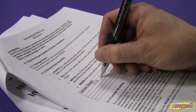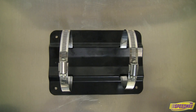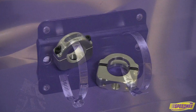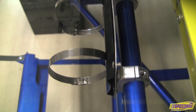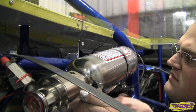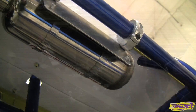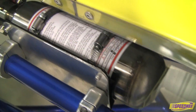The cylinder mount bracket can be mounted two ways: flat against the reinforced metal surface using the 3/16 holes provided and four bolts, or by utilizing an all-in-one accessory clamp to mount the bottle bracket to a roll bar. Test fit the cylinder onto the bracket to check the orientation of the ports for the nozzle lines, making sure they have a direct line of sight to the cockpit where both the nozzle and the detection tubes are to be routed.